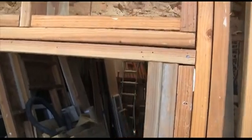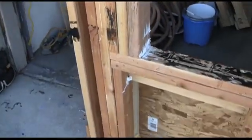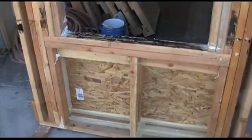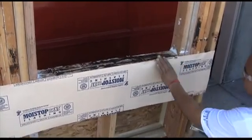This is our mock-up assembly for a flush mount window. You can tell from the residue that we've used it quite a few times — try not to let that annoy you. The first step is we're going to apply a bib, and this is to allow building paper to be tucked up under later.